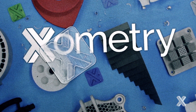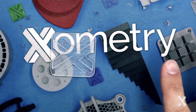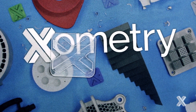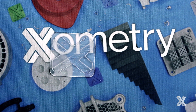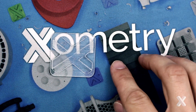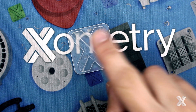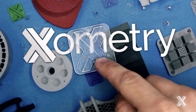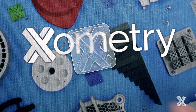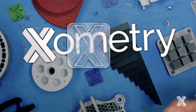All these parts build translucent because that's the surface finish that's dictating how the parts come out. In this case, this is PolyJet, so it is inkjetted back and forth. It gives you a little bit of streakiness on these upward facing surfaces and more of a matte look on the sides here. PolyJet is about two business days to ship, so it's super quick — sometimes quicker, honestly. It's something that I can get expedited very easily if I need a clear part very quickly.